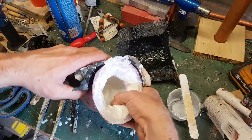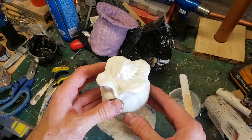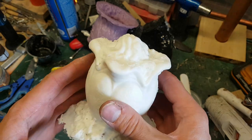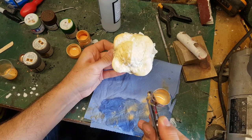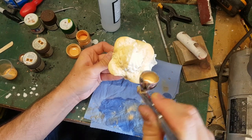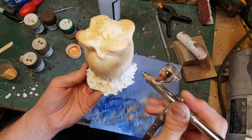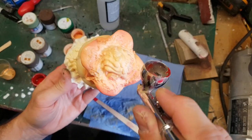After about half an hour I can take it out of the mould. Looks pretty good — not distorted and I can't see any mould lines. There are some air bubbles here and there, partly because it's quite a complicated sculpture with all that organic detail, but I don't think that'll show once it's painted up. I can now start painting. One thing I didn't do was undercoat it, and I probably should have — I did notice a bit later that some paint was coming away quite easily. The reason I didn't was because I only have grey undercoat and I wondered if it might make things look too dark under light colours. Lesson learned. I'm giving it a base coat of flesh colour first, and I'm also adding some red at the edges of the lips to give them a more organic look.